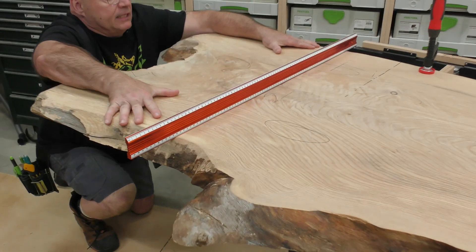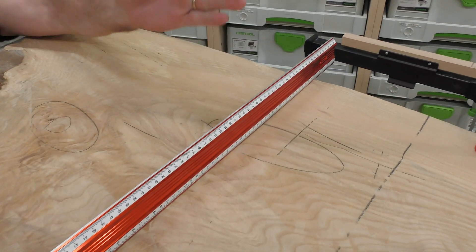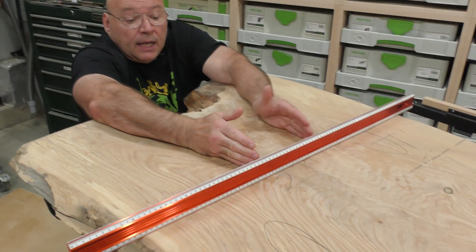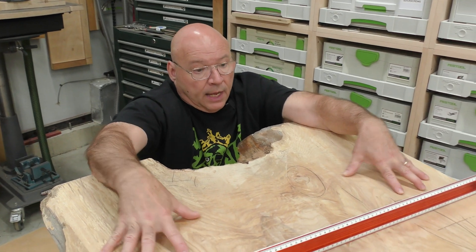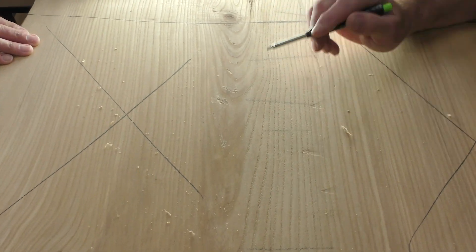We have taken down this side and this side really well. We had a wide cup; now it's a lot narrower and much less pronounced. What we're going to do is concentrate on the middle area when we hit it with the Rotexes. I want to teach you a new hand plane technique — we can see some tear out in here that we can address before we hit it with the Rotex, saving us time.